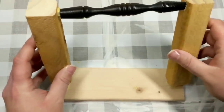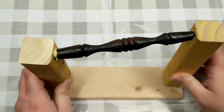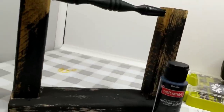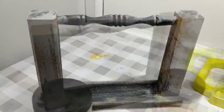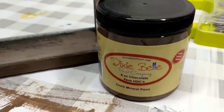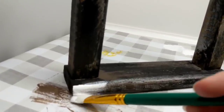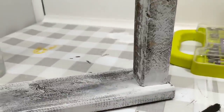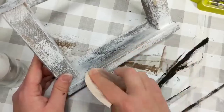You're then going to shove your dowels down in the hole. I do leave a little bit of the shavings because inside the wood glue it helps attach the pieces a little bit better — it's a complete preference. Now we're going to give this a rustic look, starting off with black paint. I'm going to layer it by distressing with more colors — this is Dixie Belle's Driftwood. Then I'm giving it a coat of Chocolate, leaving pieces open so you can see the different colors. For the final layer I'm taking a little bit of Dixie Belle's White Cotton and going over it, leaving some exposed areas where the color peeps through. Once that's completely dry, it should have that rustic weathered look, finished up with some sandpaper distressing.